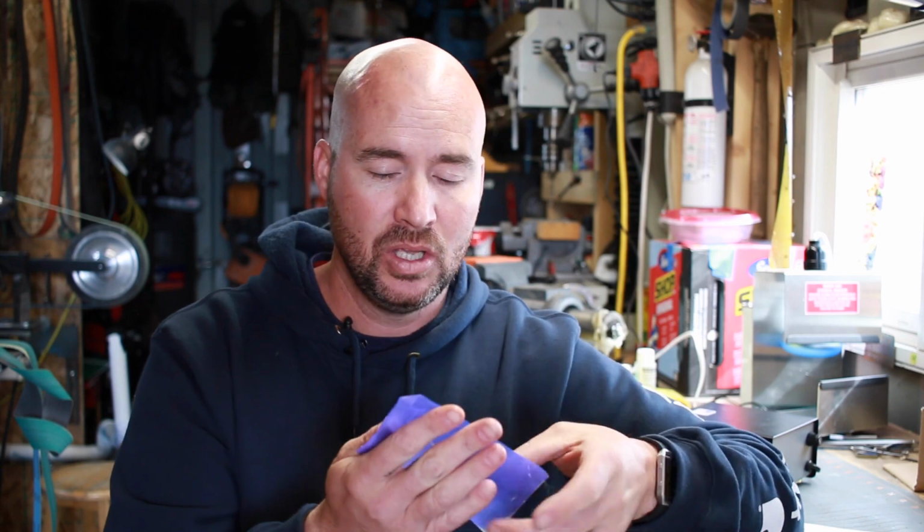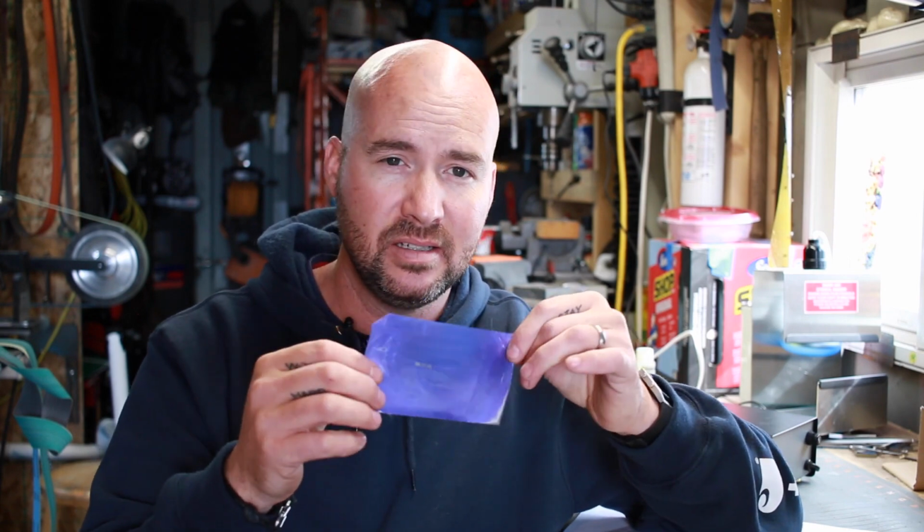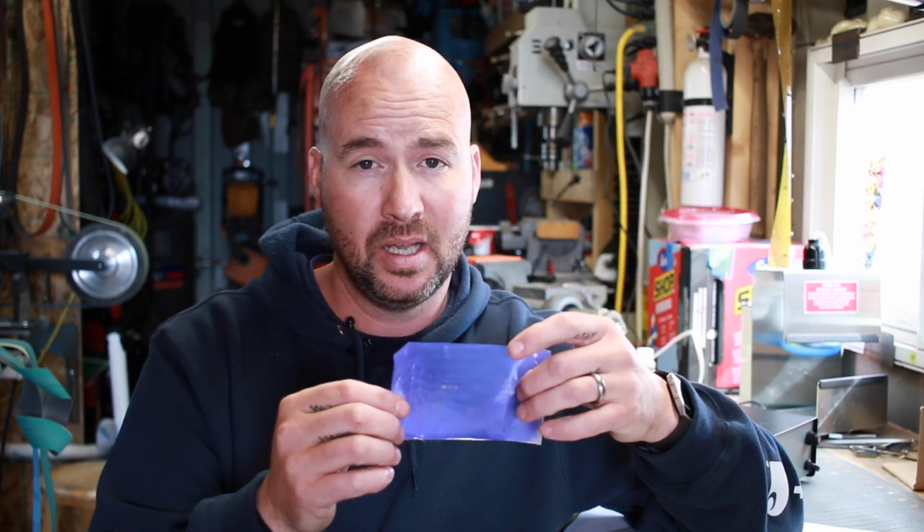And then when you're storing your stencils, I put them in between a couple of pieces of paper and in a file folder, you know, squish them between some books or something like that. You want to keep them nice and flat, and then just pat them dry when you're done with them. That's pretty much it. Look after them. You want to pull them out right when you're going to use them and put them away again. Not something you really want to leave around the shop, because any grinding, abrasives or anything like that, they're going to start tearing away at this stuff. It is fairly sensitive, fairly delicate, but at the same time works really good, and such a clean finish you can get when you're using these stencils.